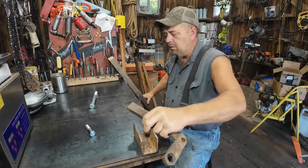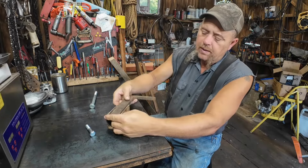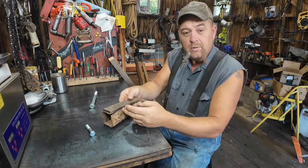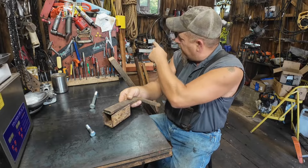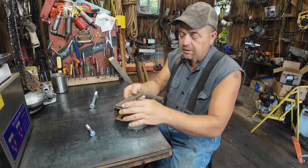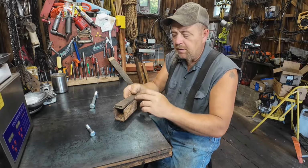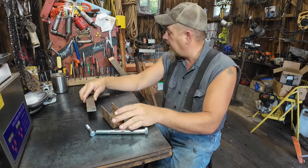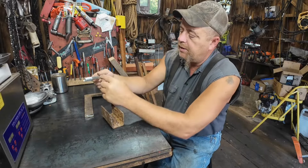So I welded that in there, and of course you want it poking out this way, and I also welded this in. Then I welded this across my 6-inch channel, and I welded it at just a smidgen of an angle. Matter of fact, I had that tapered down even farther towards the handle, and I slid it. I left about that much handle sticking out, and I let this follow that taper, and I just tacked it in 4 places, slid it off her, and welded her the rest of the way up. So that's setting at a taper. Then I cut this bolt off. You can see I cut her off about so much, and you cut that off at an angle.